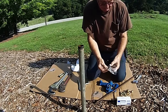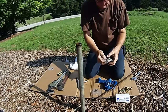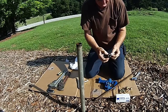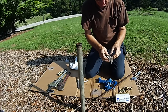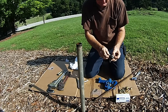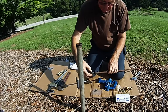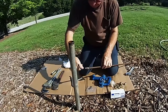Now you're ready to install your new plunger. Your new plunger comes in a bag with a silicon-based lubricant on the plunger. Make sure that you spread this lubricant all around the plunger before installing it down into the pipe. Screw on your new plunger and make sure it's securely tightened down.